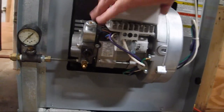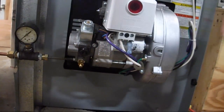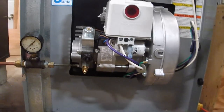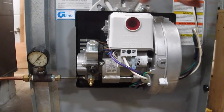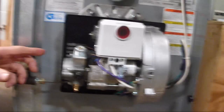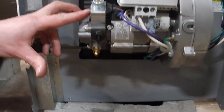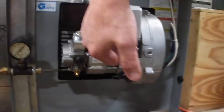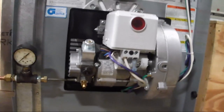So we're going to be able to fire this one up. Would they all be the same as those controlled ones? Primary controls? I think so. I've never really worked on these — I've only just played with them. But I'm pretty sure these are all the same. Is this the solenoid that's like on the other one but they have it internal to the pump? Yes. Here's your wires going to it. So that's got your delay solenoid to give it a good fire — that'll build up pressure.